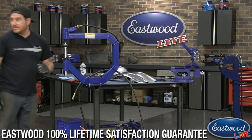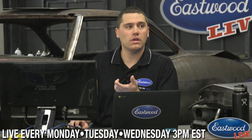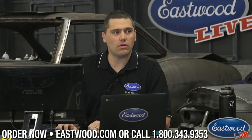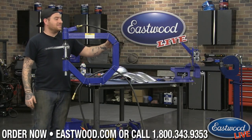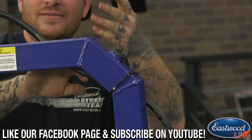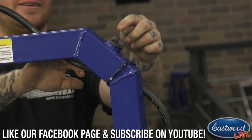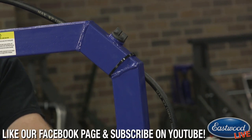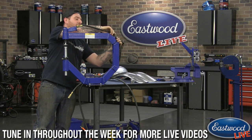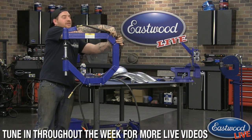Any other we got? Not a one we have, but I can also offer a quick tech tip. In the back of the unit, you can help deaden the sound. You can fill it with things like steel shot, sand, or any dense material. I think we have ours filled with some of our blast media, some of the aluminum oxide. So there's actually a fill hole on the top of it. You can fill it to help deaden some of the sound, so it's not real bad. So I just figured it'd be a nice little quick tech tip. Our stand also has them in it as well. That's a good point. So that's definitely necessary for deadening some of the vibration and the sound.